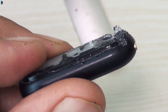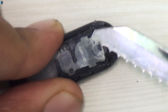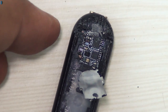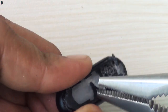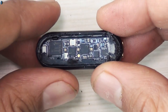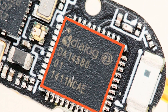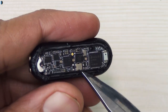Cracking this open was very difficult. We tried different parts of our tool and cut a little part on the side of the tracker to get access to the bottom layer. What you see underneath is a printed circuit board with all the circuitry on top. It is a very compact, independent embedded device with software and hardware integrated. The biggest chip you see here is the main processor that controls the functionality of the device. There are also accelerometers and other microprocessors present.